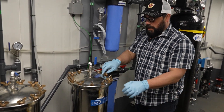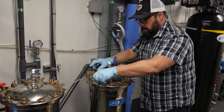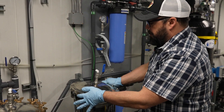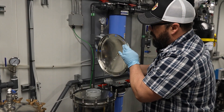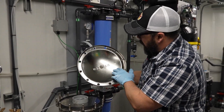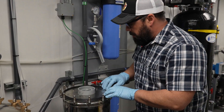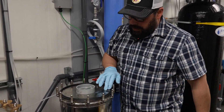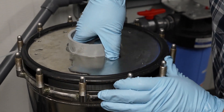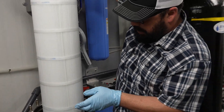Then you've got a process of pulling all these nuts off. Once the nuts are all off, you remove your lid. You check the inside of it for any damage, rust, wear, or potential issues that could hurt the integrity of the lid. Then you open this up and you inspect your rubber seal on here that would seal on your lid. If you don't see any damages, then it's time to remove the filter — lift the whole thing up and over into our water catch.